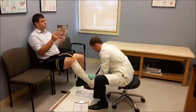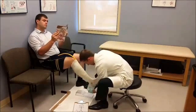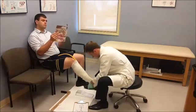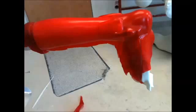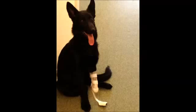Here's some background on what we're talking about. In school and in our residencies, we were taught the traditional method for treating patients and fabricating custom orthotic and prosthetic devices. This method begins with taking a cast of the patient's anatomy, filling that cast with plaster to form a mold, and modifying that plaster by shaving away or adding plaster to obtain the desired shape. Then plastic is heated up and vacuformed to the outside of the mold. The desired shape is cut out, ground, and buffed into its final form. The finished device is fit to a patient by a certified orthotist or prosthetist, like us.